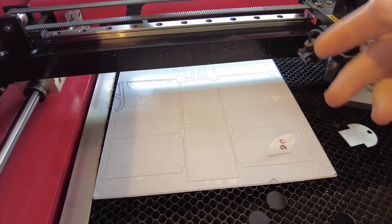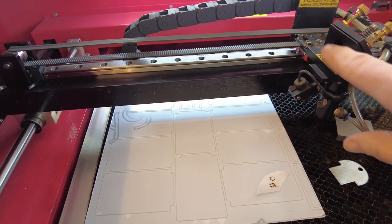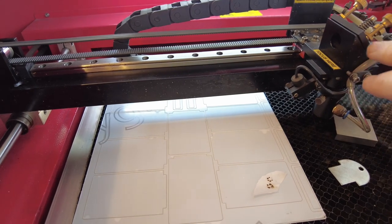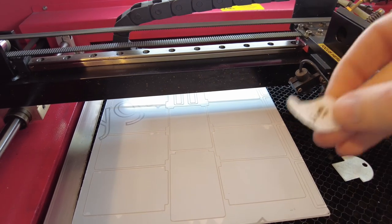One of the things that can cause this problem is dirty mirrors. I actually have a preventative maintenance routine where I regularly clean things, but I thought maybe something's gone wrong, it's got extra dirty. I had all the mirror assembly apart, cleaned everything — nothing was wrong seemingly — so maybe it was mirror alignment.